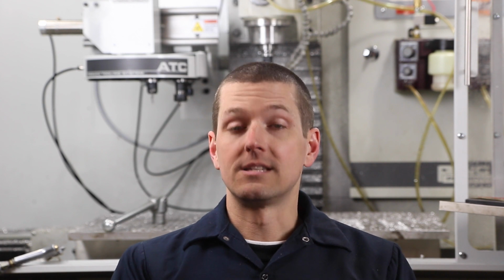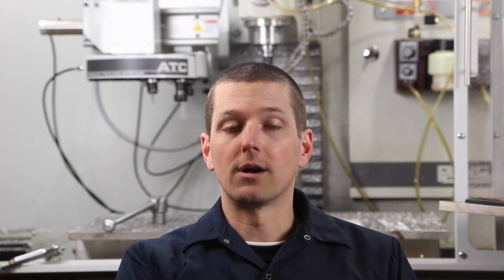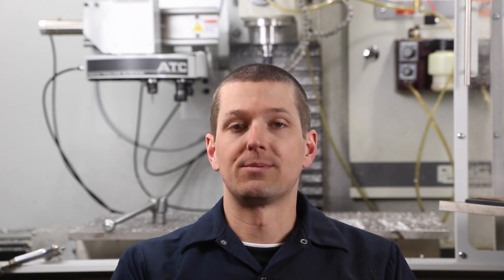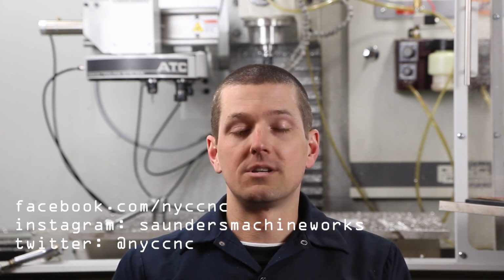So when I figured this out, I absolutely wanted to share it with you guys. It's a really cool part. It's this eagle coin. And what we do in SprutCAM here, the big takeaway for me, was to get away from roughing waterline and use roughing and finishing planes, with, I wouldn't call them tricks, but little tips on how to do that in a somewhat efficient manner. This is the type of part where there's not a lot of difference between CAM that is 2 hours of runtime versus 8 hours of runtime, and the results, hopefully, if you do it right, can be similar. So you want to try the 2 hour one if you can.